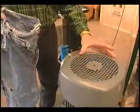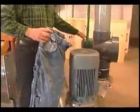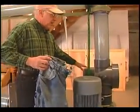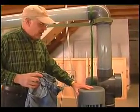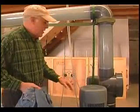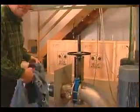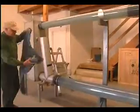The camera's showing pump number one is on — you can see the rotation of it. Pump number two is off. Both pumps are in auto mode with pump number one being the lead right now. We're going to drop these jeans in and see what happens, the response of pump number one and then pump number two. So I'm going to walk back to the inlet and drop these blue jeans in.